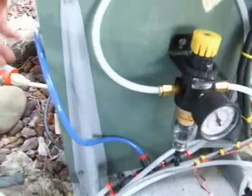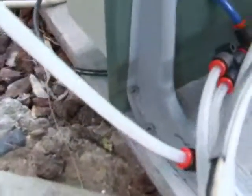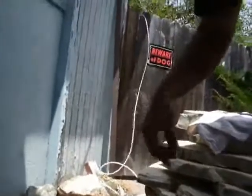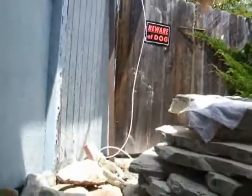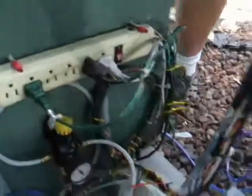You'll notice another line going into a T — that's the main exhaust port out. The reason I have that hooked up is it just spits out all the used air from the solenoids, and it makes a hissing noise every time it expels the air. So I put just a piece of hose that runs off somewhere else so you don't hear it right at the prop.